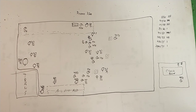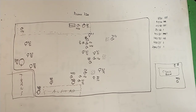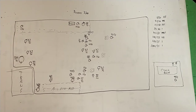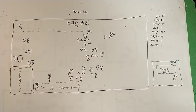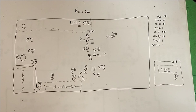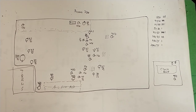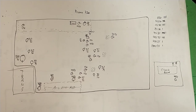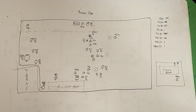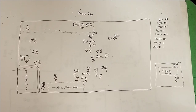I've drawn out a map of the machine. The dotted areas are locating marks — identifiers to gauge where I'm at on the board. All the values are written to the upper right — value and voltage — and I even included the clock board. It's just a matter of acquiring what I need, marking the caps on the opposite side of the board, de-soldering them all, removing them all, and replacing them. Then we'll fire it back up and see if it behaves itself.